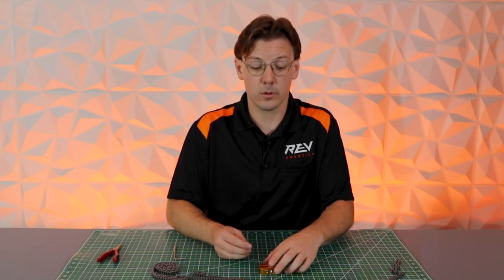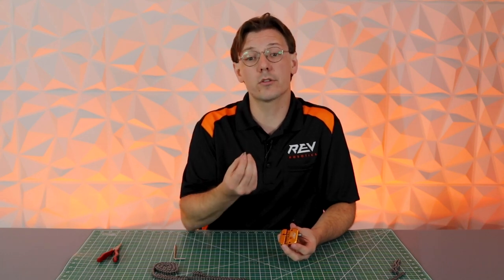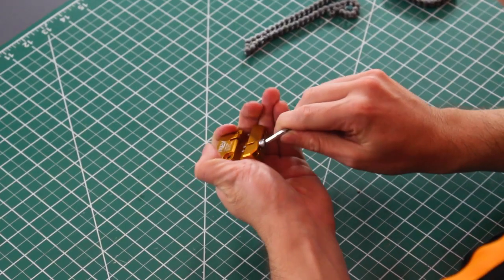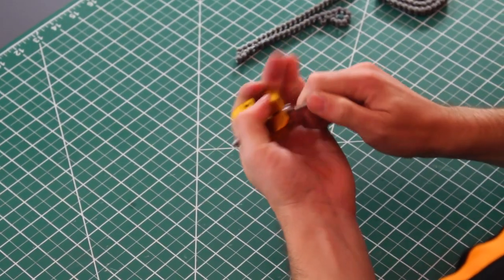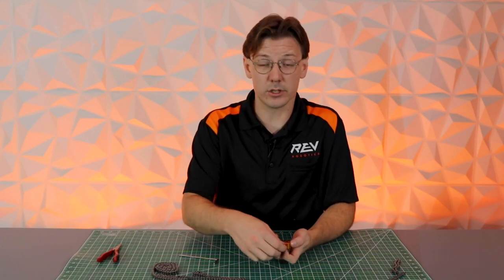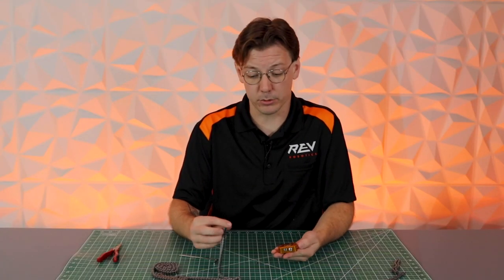Next, we're going to cover breaking chain while using the pre-existing pin — not a master link. Most of the steps are the same. Make sure the guide is clear so the pin and compression set screw are not in conflict with the chain running in the guide. Also make sure that the cup point screw is screwed into the bottom of the tool to help prevent the pin from coming out. Due to manufacturing tolerances on the device, this helps make the process easier but is not guaranteed every single time. This will require a little bit of touch and feel and may need some practice to perfect.